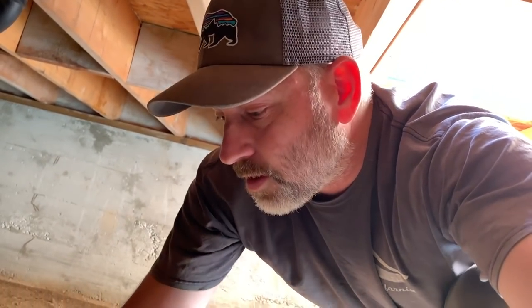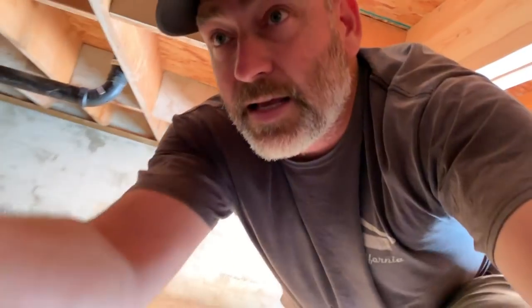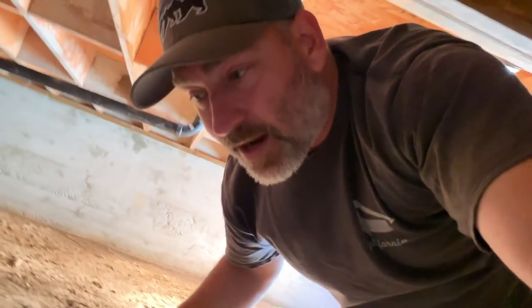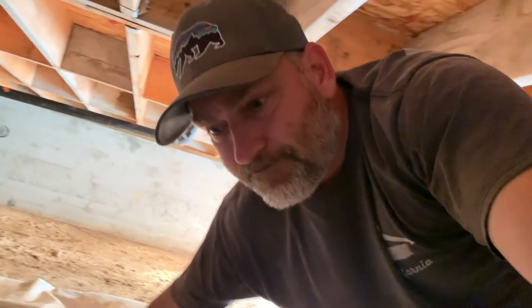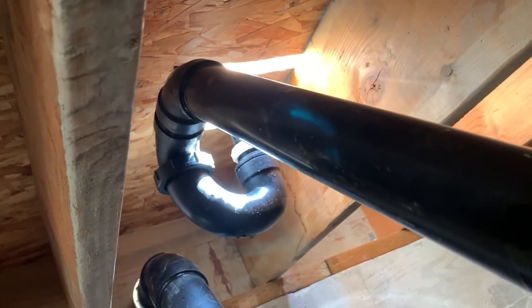If you've been following along on our build here, we've been plumbing for a few days now. And I made a major mistake in my last video. I forgot to vent the bathtub. Look at that, man. Terrible. I had an idea of how I could fix it, but I didn't hear back from the inspector and I'm tired of waiting.